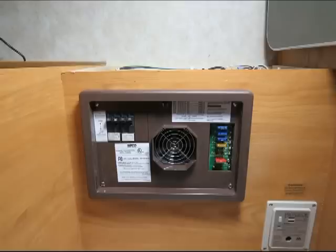What you do is you're running on shore power, so you've got your shore power working. You can pull a fuse and see if something goes out. I would have everything in the place running and see if the fan works on the converter. Have your refrigerator, fantastic fan, your lights, your microwave, everything you've got that could possibly normally run, and make sure everything's doing great and that you don't have any smoke or anything coming out of the converter, which you shouldn't have.